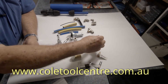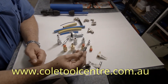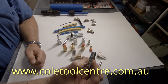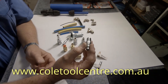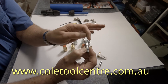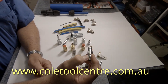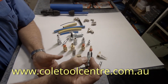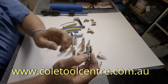We'll quickly go through the Nittos, as they're the most common. Now that one there has got 20PM — all of those numbers mean something. The P is the plug, the M is for male, and the 2 gives us the diameter of the male. So that 2 means 2 eighths, and 2 eighths is a quarter. So that's a quarter male by a plug.